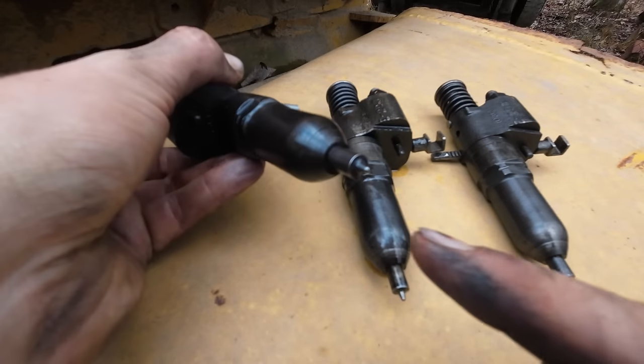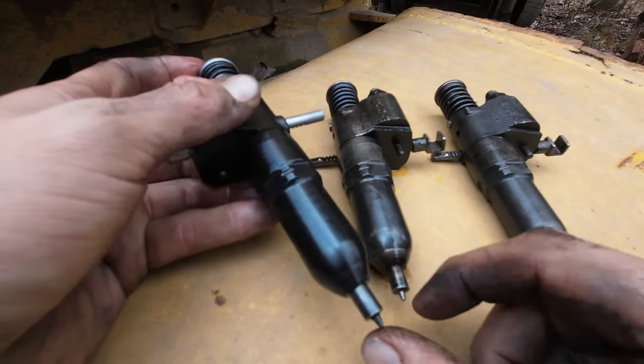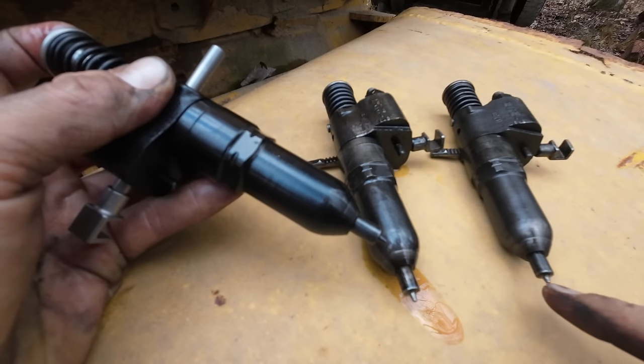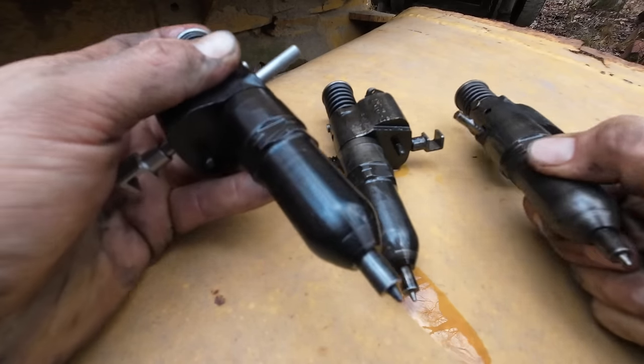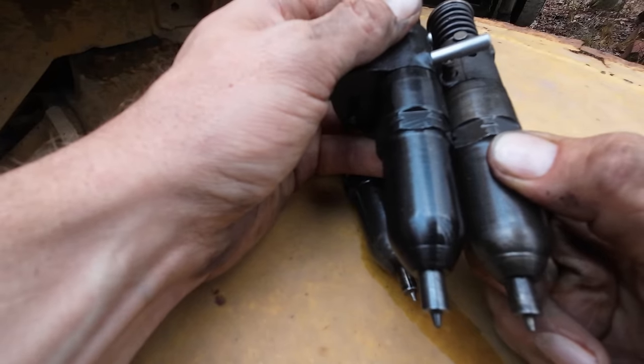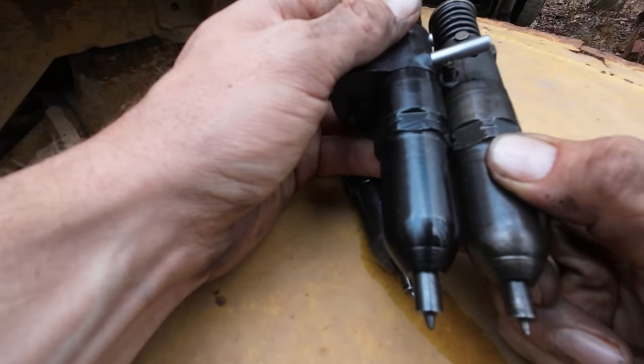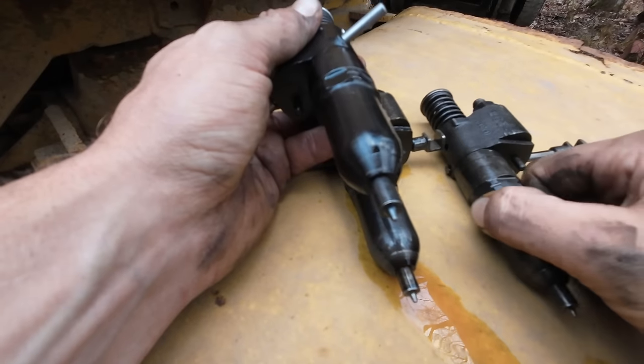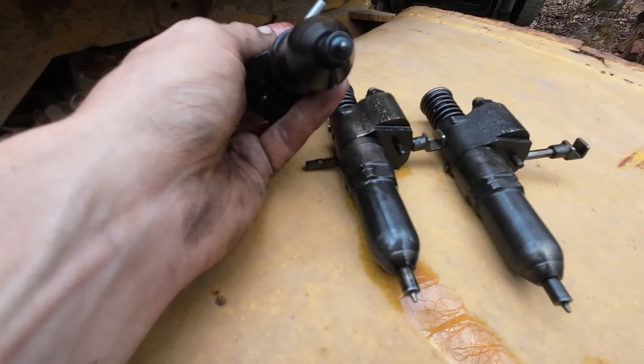But the tip here, where your fuel comes out and is atomized, this one here, I don't think he got very bad, but this one over here is significantly shorter on the tip length, and it's on an angle as well. So he definitely caught it with the whiz wheel pretty good. So that fuel was probably not atomizing out of there at all.